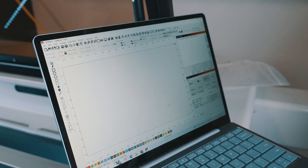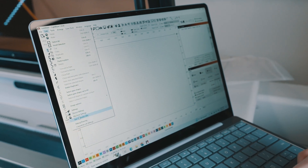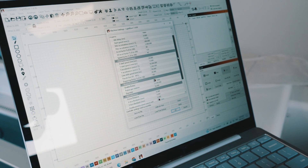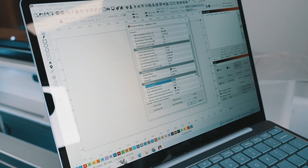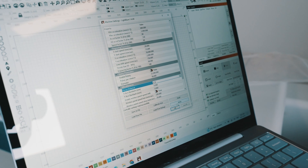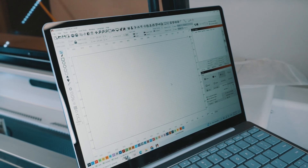With your laptop connected to your laser through USB, open Lightburn and go into the Edit menu, then go down to Machine Settings — that'll read your controller settings. Scroll down a little bit and under Miscellaneous there's Focus Distance. We determined we need to change that to 5.5, so we're going from 6.5 down to 5.5 millimeters. Click Write and that saves it to your laser. Then click OK and perform an autofocus test to make sure it's saved.